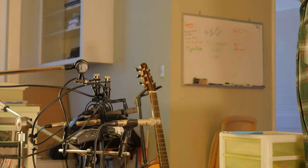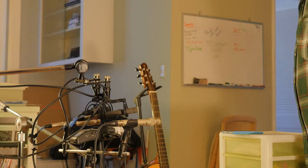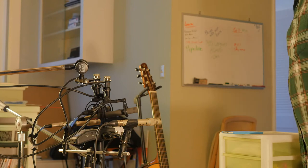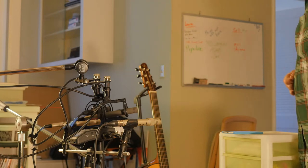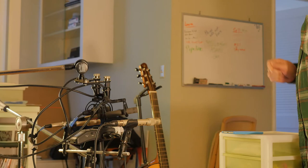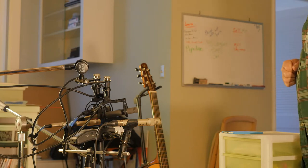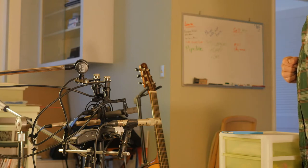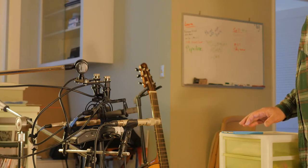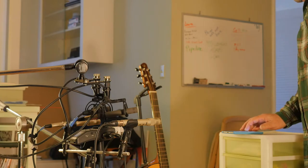As always, when I do a comparison of different kinds of recording systems or devices, I think it's important to have matched volume levels because our ears change how they hear things at different levels. So we'll start off by printing a test tone on all three mic array tracks so we can use that to adjust levels in post, so that they come out at about the same level. Here comes a 1kHz test tone being printed on all three tracks.